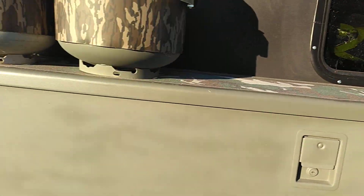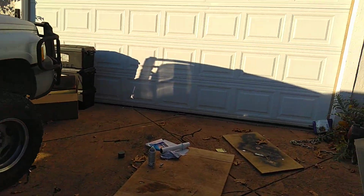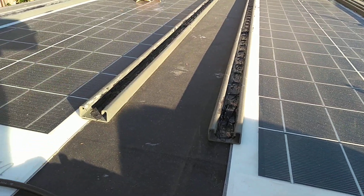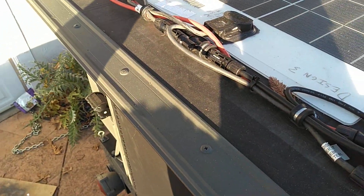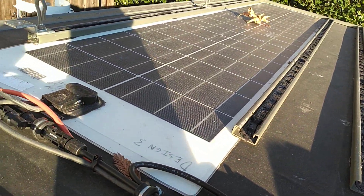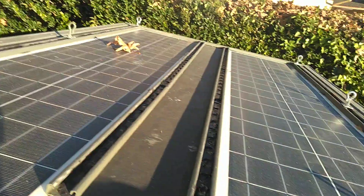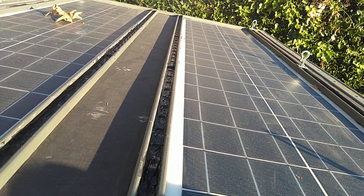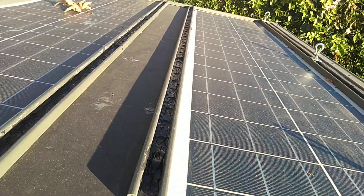The skin is a polypropylene product made for boats — it's a marine grade product. The roof has got a 60 mil rubber membrane. There's some Unistrut up here as well for the solar bits. This does 200 watts to the solar. These panels put out 20 to 24 volts depending on how warm it is out and how bright the sun is.